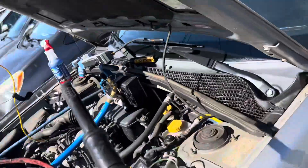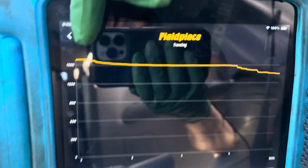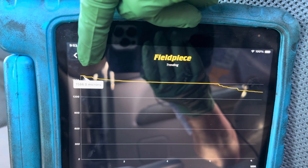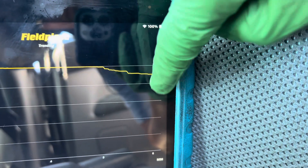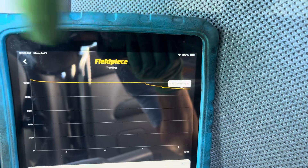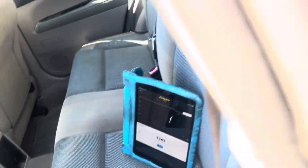I was going to do a vacuum decay demonstration. You can see it right there — 1500 microns at 88, that was with it running. You can see the point where I shut off the valve and the vacuum actually went down and keeps going down. That's covered in another video. There's a big leak but it's not leaking right now under vacuum.